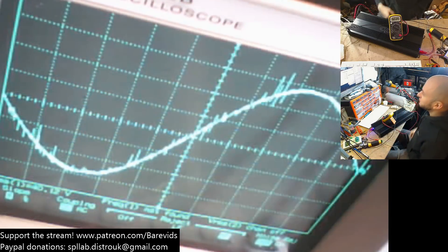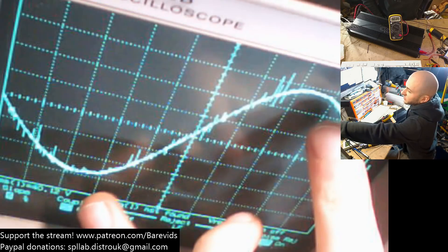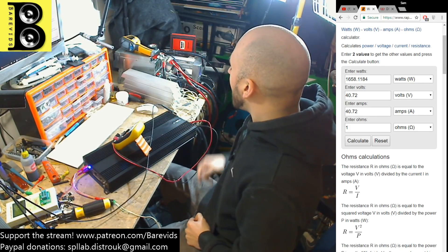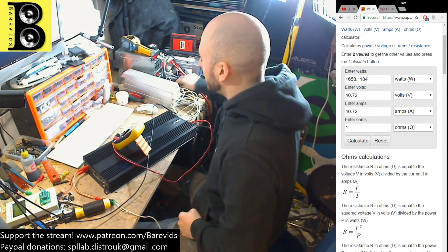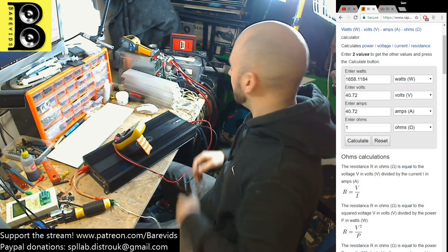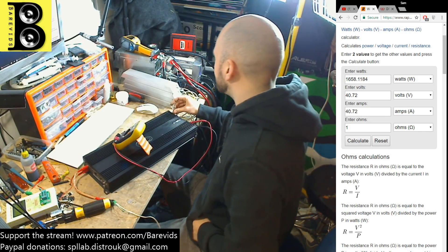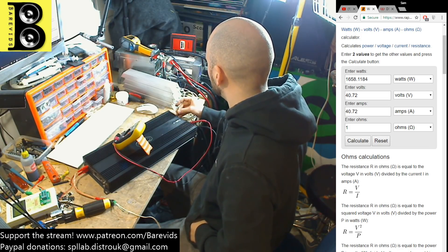To get this amplifier to do rated power, the wave would have to have a very small bit of soft top and bottom clip — about between 5 and 10% THD. Not bad at all for the size of this thing. There may also be a very small error factor with the square law correction factor we're using. I do plan to get my 14 volt supplies hooked up very soon, and I will redo this test and post the results to my NSV and BearVids Facebook pages when I get my 14 volt supplies hooked up.